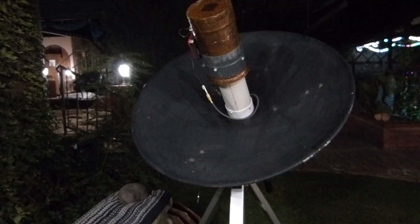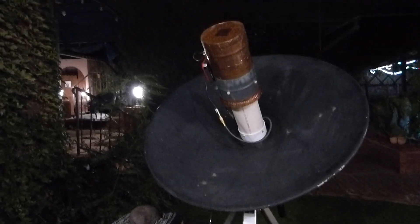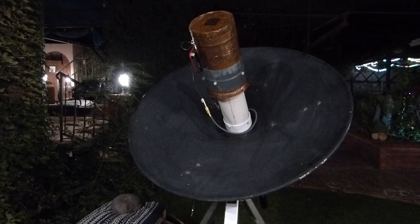The antenna grew a little bit. This is the bigger dish I was trying tonight — part of the experiment is comparing the two dishes. Here's the other one over here; that's the one I was using. That is such a pretty little dish — military surplus, built like a tank. This bigger one actually gives me a few more decibels — not much, maybe three or four — but three dB is twice the power, so it does give me more gain.